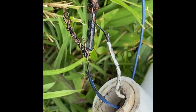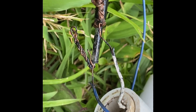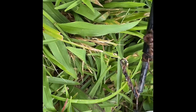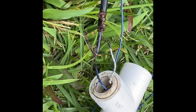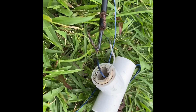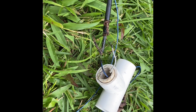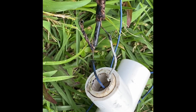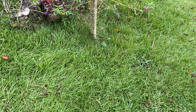This is what the connections look like — kind of gross. And this is where the balun should be. But I don't have the toroid. However, I would recommend making an air choke, which is just a coil of the coax around some sort of form, if you have extra coax. I did not.